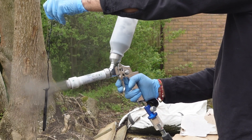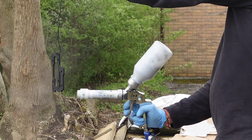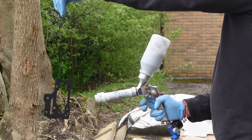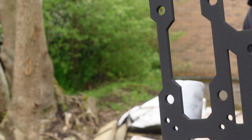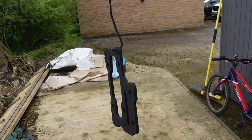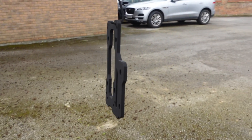As this is a small one-off part I'm just doing a quick spray outside. For much larger or critical parts I'll generally spray these in a pop-up tanning tent to catch most of the overspray and make less of a mess. I generally don't bother with the grounding strap, but even then you can see how evenly and how well the powder is adhered to the part. The powder I've used here is satin black and you can see that it looks more charcoal in colour before it's cured.